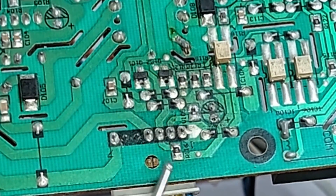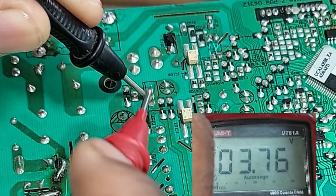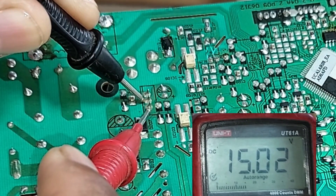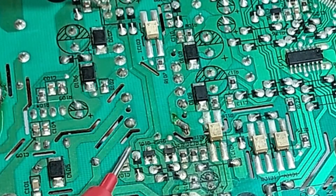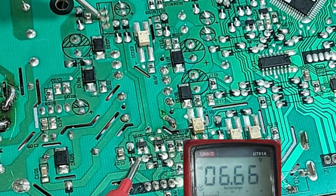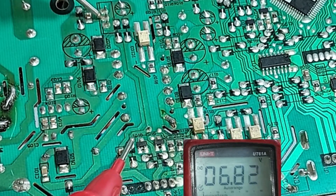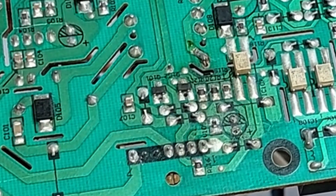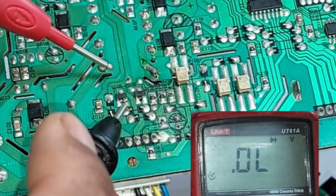Other problems could also be present here. I am now checking the volts on the voltage regulator by placing the probes on its pins. 15 volts are present on the voltage regulator. The trace on the left is positive and the trace on the right is negative. This trace moves further and 15 volts are passing and moving further on both transistors. The transistor is not able to pass voltages. I have disconnected the electricity, so I will now check the transistor.